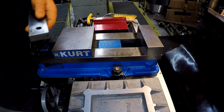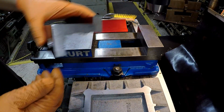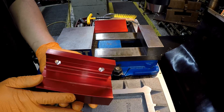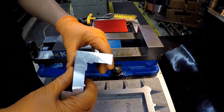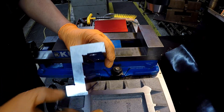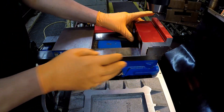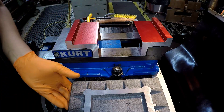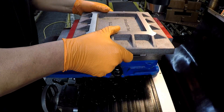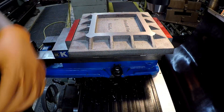I've never actually taken the opportunity to use these for a job, so that's what I want to do. I want to get these things bolted in — it's really neat how they bolt up to these ribbed sections and everything squares up nicely, pulling against the jaw and down at the same time. Then we'll set our fixture plate in here, get it centered up, and get to our drilling and tapping.